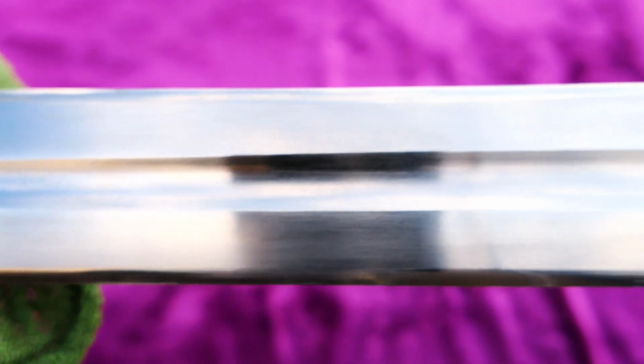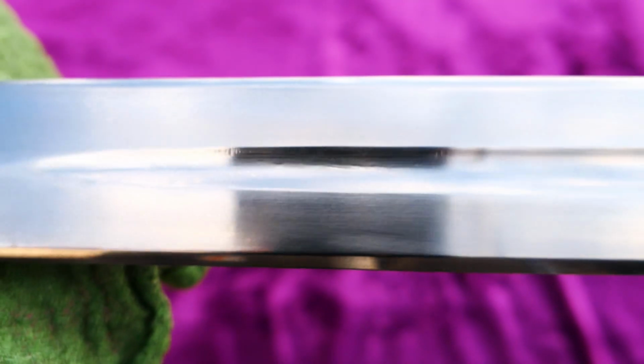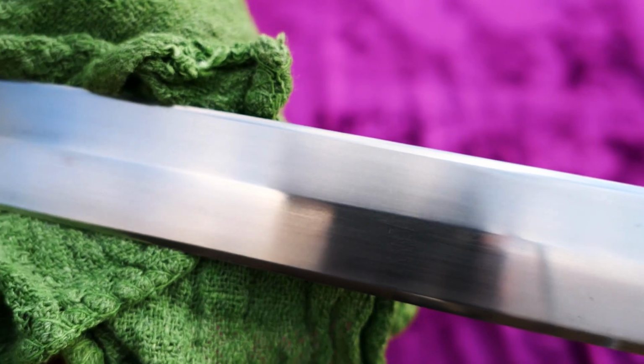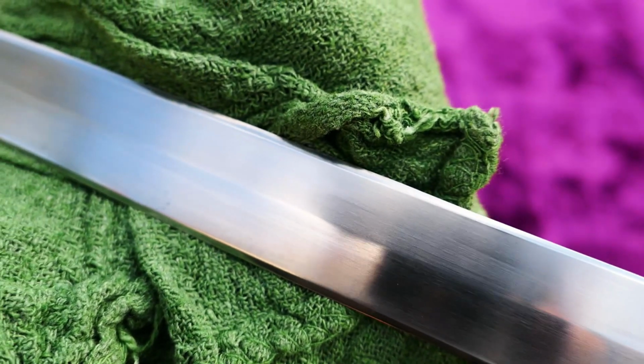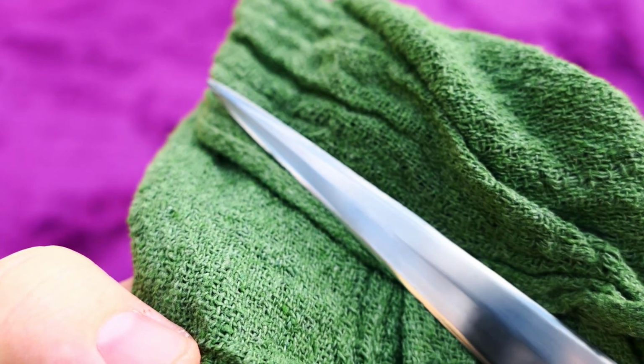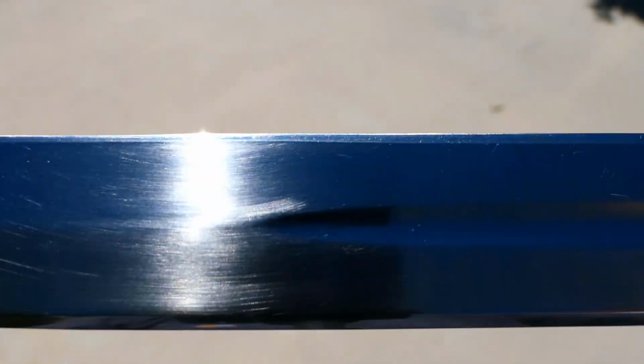One of the defining characteristics of a Type 16A sword is the long, even profile taper, which this sword nails in my opinion. The fullers run about 13 inches, terminating gradually on one side and a little more abruptly on the other. There's about 1/2 inch of difference in where they terminate on the blade. These kinds of small asymmetries are not uncommon in hand-forged swords, and they don't bother me, although some people would find them infuriating.